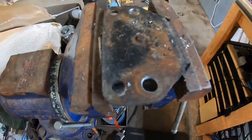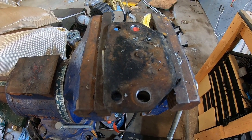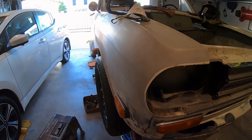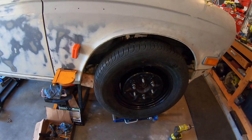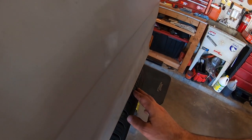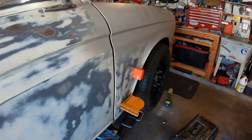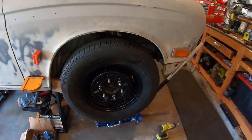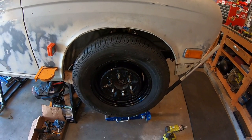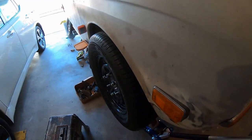I forgot to mention you have to drill out your motor mounts a little bit — that's the only downside. If I ever buy a new motor mount in the future I'll have to enlarge those holes, but it's not a big deal for the extra strength. This is what a two-inch wheel spacer looks like on the factory 14-inch wheels — the tread doesn't quite reach the fender but the tire definitely does. It doesn't rub on the P6 calipers.